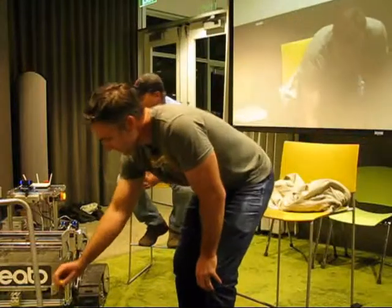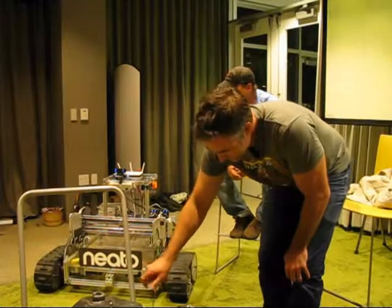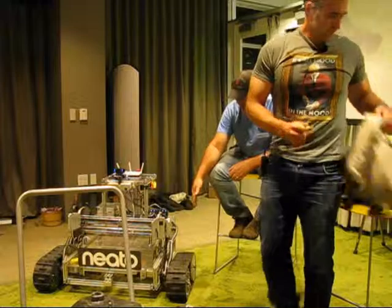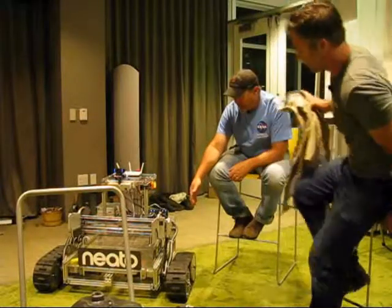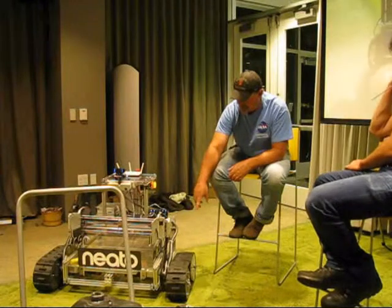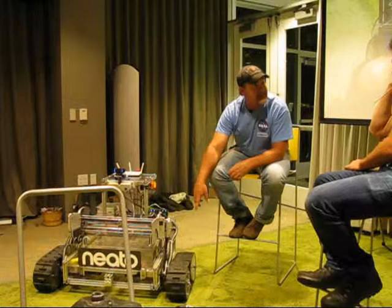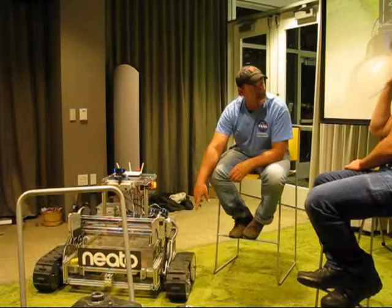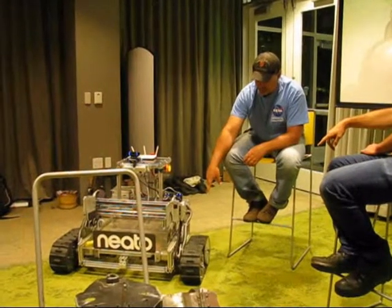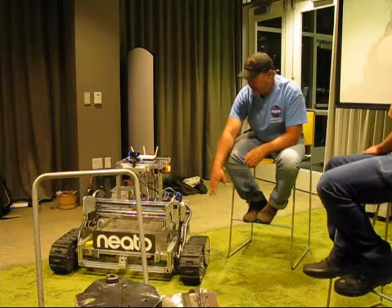So this thing we call the Beast. Bruno named it the Beast at some point in the Git repository, and so it lives. The treads originally were, like Chuck said, on another BattleBot. In the tread themselves, there's a 90-degree right angle gearbox, 2-to-1, and then we were doing, I think, 9-to-1. So it's a total of 18-to-1 geared there.